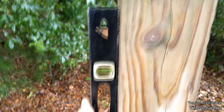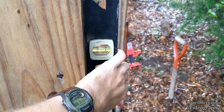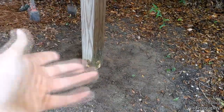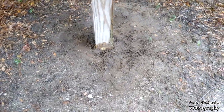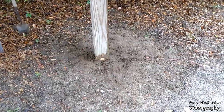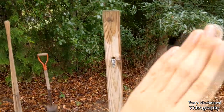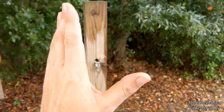I've got it ever so slightly with the top out and back in - tilted that way - because I'm going to have the gate doing this, and the weight load of the gate is going to cause this thing to migrate with pedoturbation - the active movement of soil by worms, mole crickets, moles, and everything else rooting around in the soil, as well as fluctuations in the water table. That's going to cause the gate to settle in this direction, so angling it to counterbalance will slow that down.